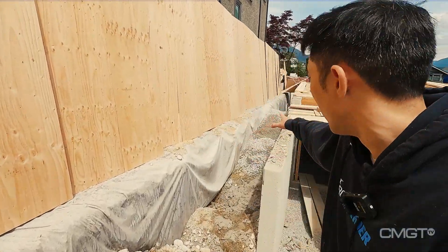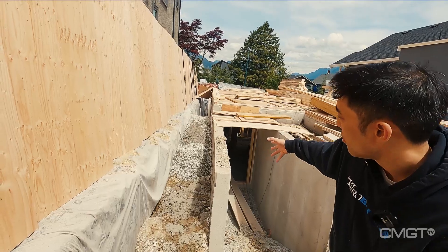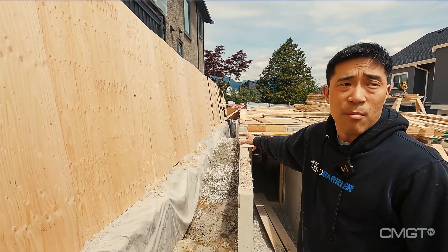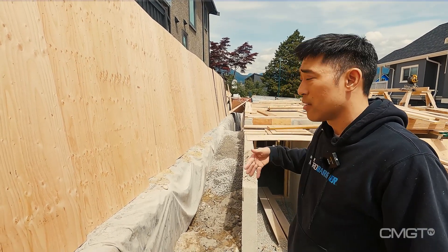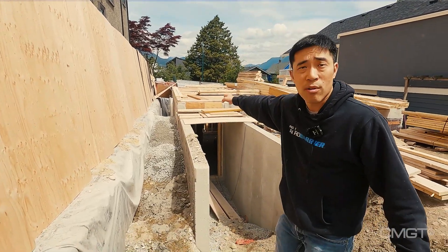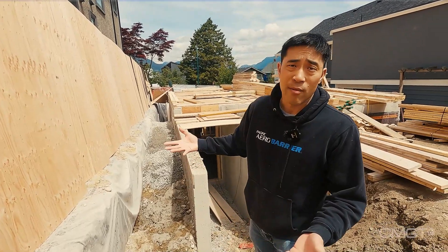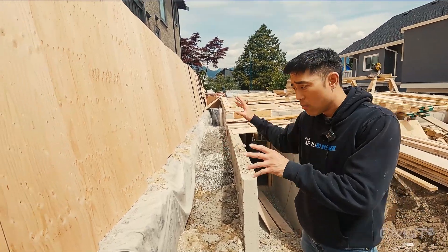Have a look at the high side of the foundation. The backfill material we used is not dirt but instead 3/4 crushed gravel. The reason we did that is because we're not able to reach far enough with a machine to drop dirt backfill in there — instead we're using a slinger to shoot the gravel exactly where we want it, giving us unlimited reach. We can shoot from the back of the property right to the most corner extent of the foundation towards the front. You can also see how we put the plywood against the neighbor's fence — the fence is actually made of aluminum and we don't want any gravel damage, so the plywood acts as a nice shield to block rocks from hitting it.